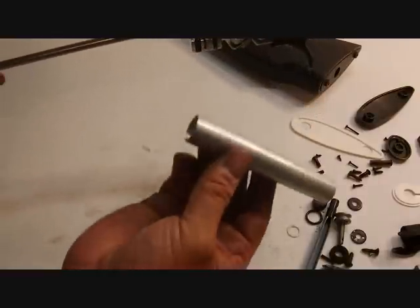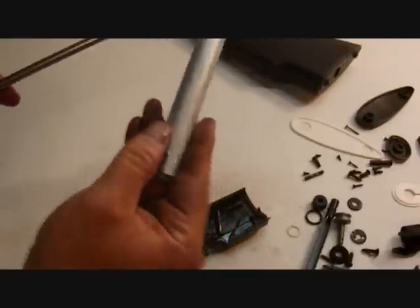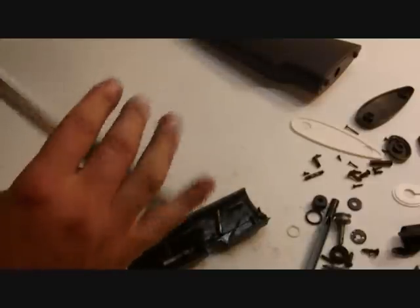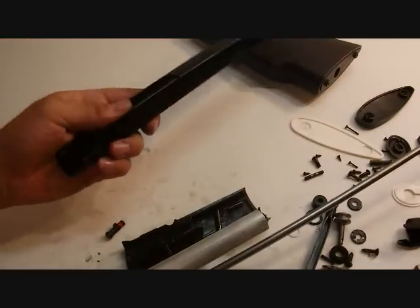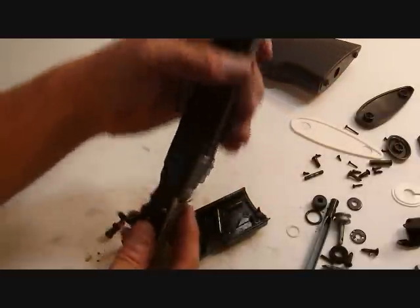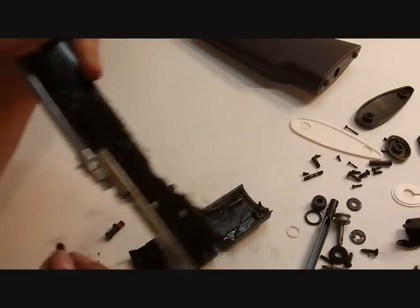With the seal assembly in place, we can put the pump tube back on. The pump tube has a slit in one end, and that goes down and towards the front. The frame rail just slips in place, riding towards the bottom. The frame rail is held in place by one pin.